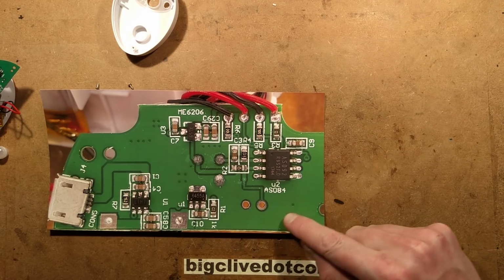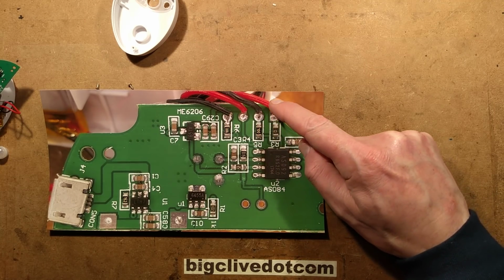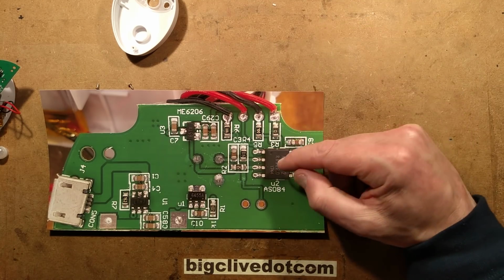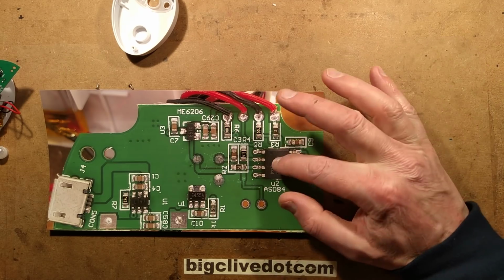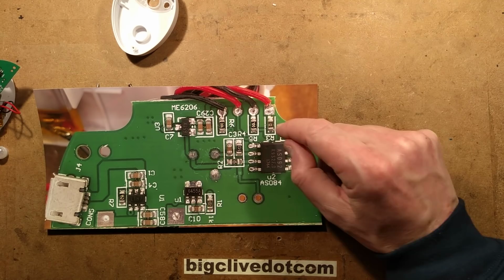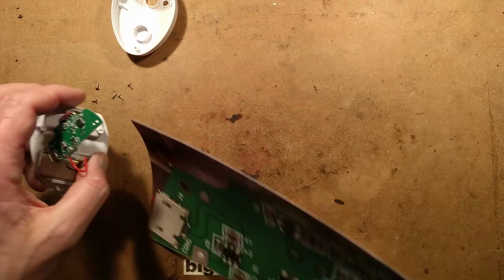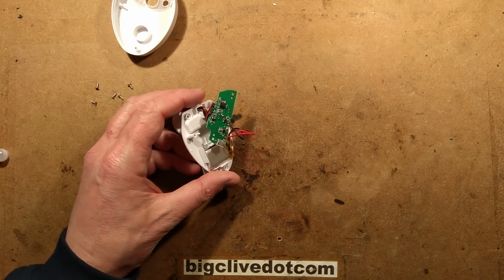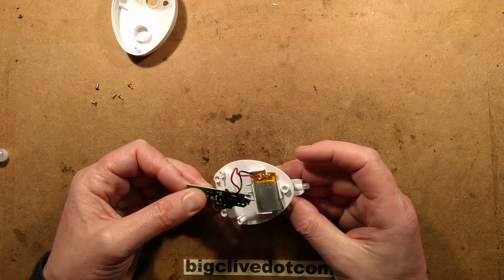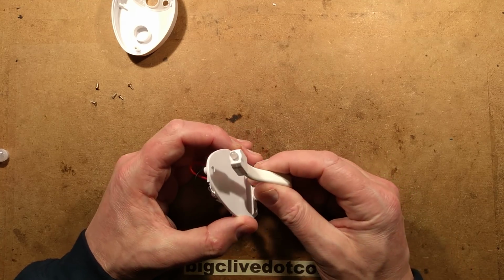Or in this case, actually, no, because this, oh no, I thought that was going straight up to that, but it's not. Not sure. Normally, they'd have the LEDs connected COM positive, and then it would be switching down to the negative rail, which makes sense because the positive rail to this one is the 2.5 volts, and that wouldn't be high enough for the LEDs. So it's an interesting little unit. Once again, it's a marvel of science being used for an absolutely flippant task of illuminating your poo. But then that's science for you.